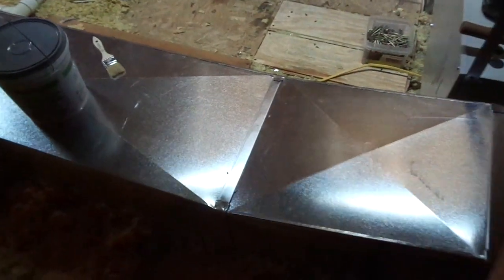We've got to build 18 inches of wall around the fan and air handler. We're going to cover the entire area with probably R44 insulation on top of what's existing and blow cellulose in on top of that. The type of insulation going on this duct is a mylar-coated bubble wrap — it's a double mylar coat, one on each side with the bubble wrap on the inside.